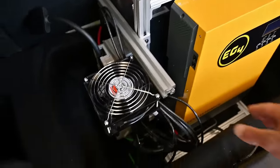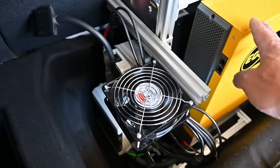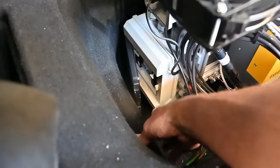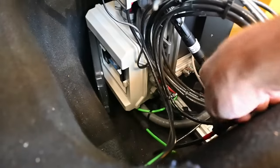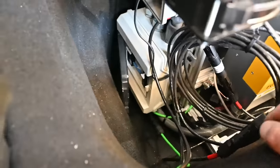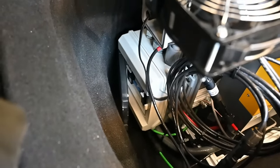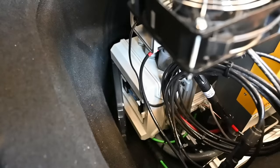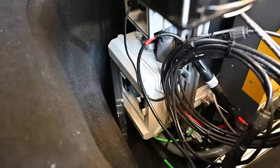The PV wire connects down here. The AC output comes out over here. The PV input goes into this box, which has a number of circuit breakers in it. There is also a 15-amp inline fuse for the PV, and then an additional 20-amp circuit breaker where you can turn the PV on and off. That's a high-voltage DC circuit breaker from Northern Arizona Wind & Sun — a 300-volt DC breaker. It's important to buy a DC circuit breaker, not an AC one, because of the time it takes to break the circuit and the arc. Down in this box there are four circuit breakers: the first is for the PV, the second is for 120-volt AC, and the third and fourth are for the DC batteries.